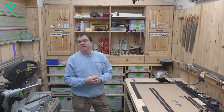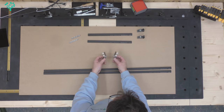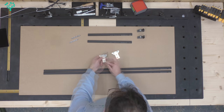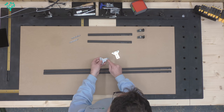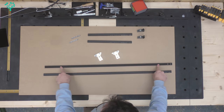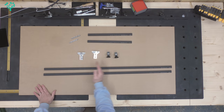This is quite a good idea because it makes the entire system incredibly compact. If you're using this in the field, that's the sort of kit size you'll have — six connectors, easy to store in your toolbox. You also get two track mounting brackets that allow you to attach your rails to your track saw. These are milled aluminium, coming with two nylon M6 knurled nuts, a couple of T-bolts and associated bolts so you can attach them to the T-track on the underside of the rail.